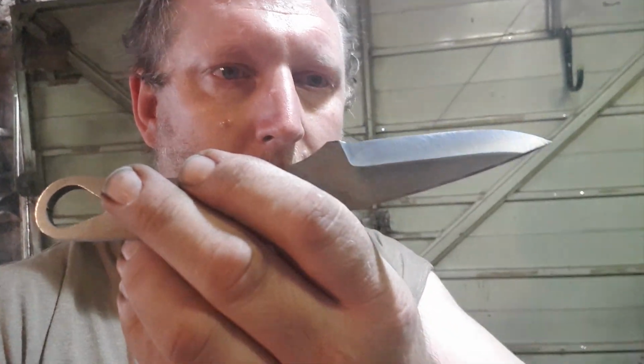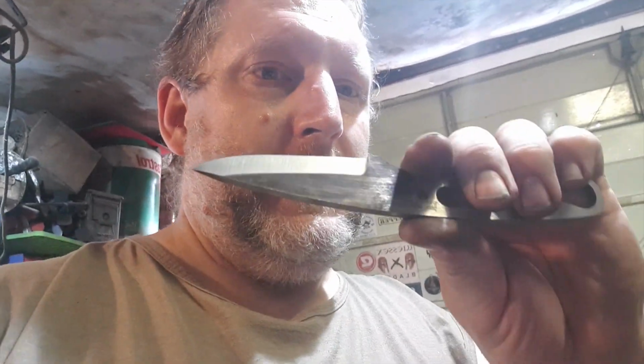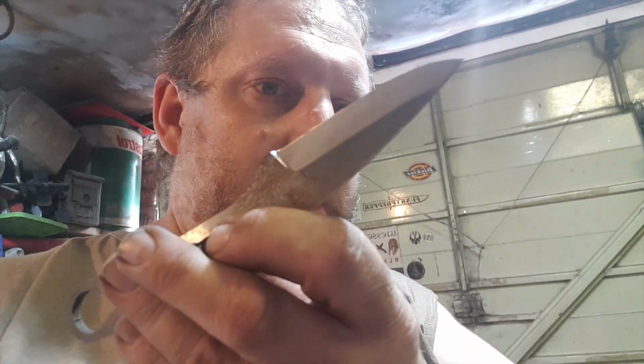So that's on a 280 cork finish now. So the steps it went up, 36, 60, 120, 180, and then a 280 cork. Seems to have done exactly what it needed for the gradients of steps as we went.